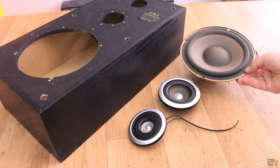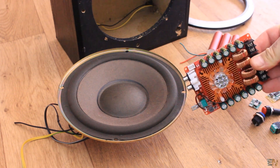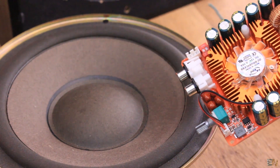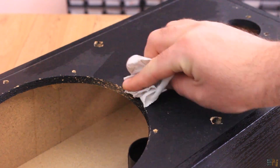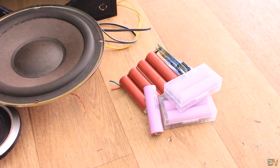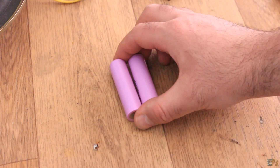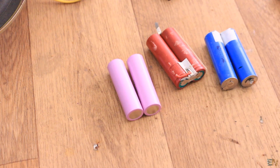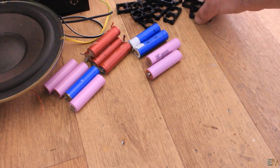The amplifier could give up to 160W at 36V, but with a 6S battery it will probably give a maximum power of around 90W or so. I first removed all the speakers inside the wood case and cleaned it with some alcohol. The next step is to make our battery pack — I want it to last longer, so I got 12 of these 18650 batteries. I solder packs of two batteries in parallel, then make a series of 6 packs to get a 6S battery pack with a voltage of 25V.